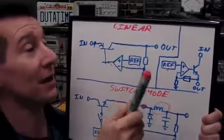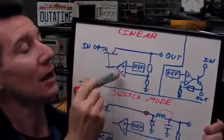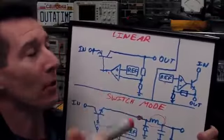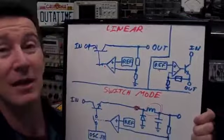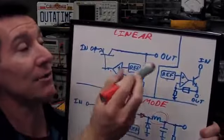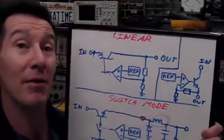So that's one of their disadvantages, and the other disadvantage of LDOs is that they have a greater ground current as well, which changes with the load. There are all sorts of fancy new LDO topologies to get around those problems, but that can be a basic inherent disadvantage, because the ground current can have a direct relationship with the output current, and it can be quite high, and you can waste a bit of power there as well.